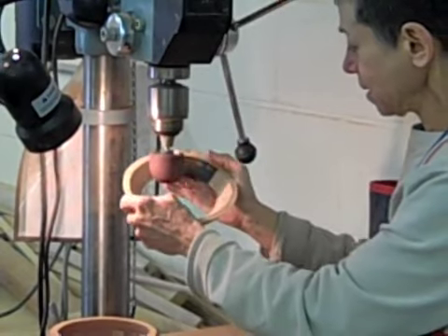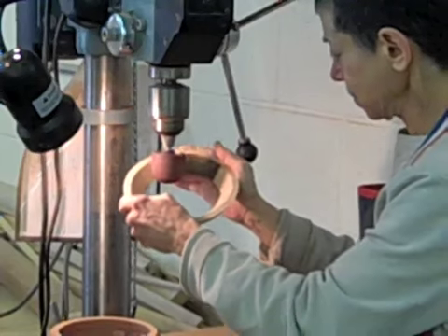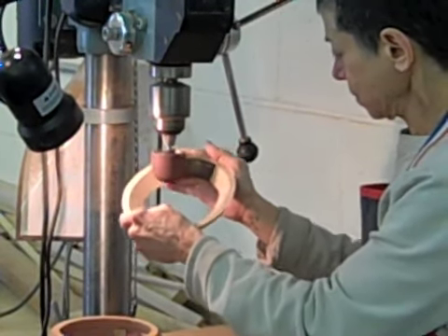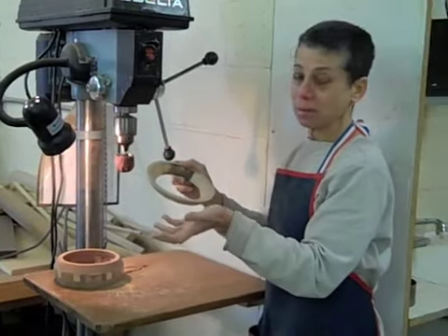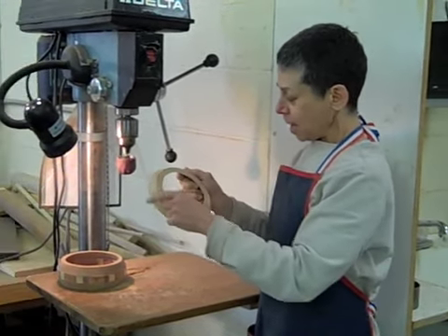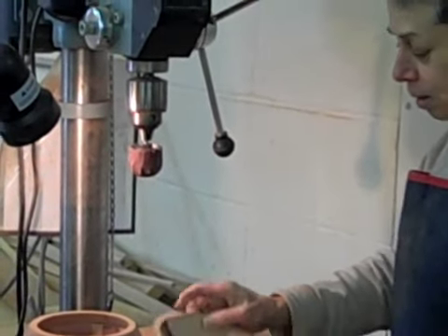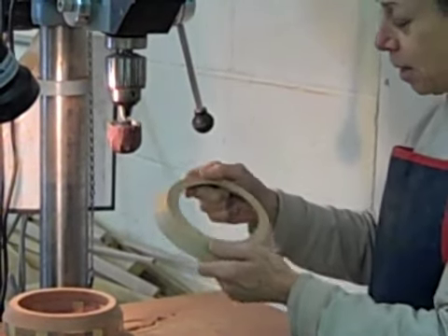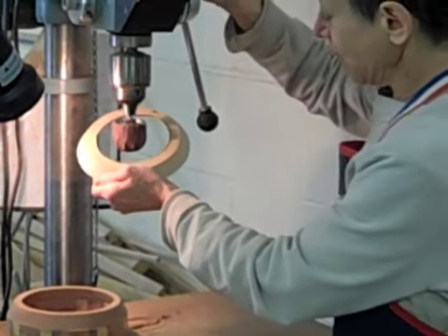Before you know it, all this ugly burn — this is cherry, but you probably guessed that — is history. Here's the important thing: if you want to get a nicely rounded bottom before you glue it onto the base, whether you're working with just the lowest ring or you've done your glue-up up to that point, it's easier to see what you've got if you turn this upside down and sand.